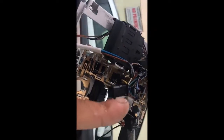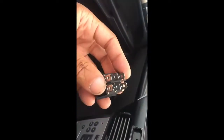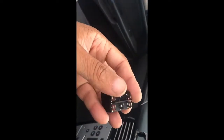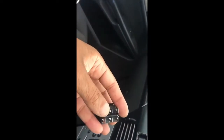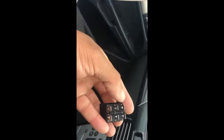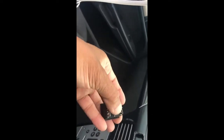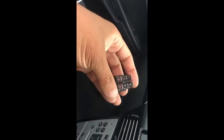You check here again — in my case I use the blue to connect to the blue and red cable, and the brown to connect to the red one. You need to figure out which one you want for opening and closing, and just connect them to the plus side. So let's say this is plus — you connect the brown cable here and the blue cable there. The minus cable you split, so the cable goes in the middle, and you can connect them there and there as well.